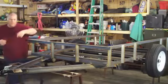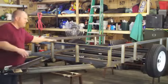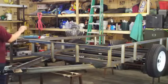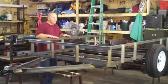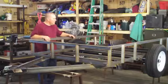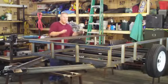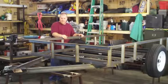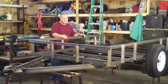I just wanted to give you an example — look at this, watch the trailer. Before this framework was on, that was flexing a little bit. Even if you just wanted a flatbed, this bridging really helps — this is what gives your trailer strength. It's looking heavier duty as we go. Once we get the fenders in, everything helps. My next step, I'm thinking I might mount the fenders, and then we can mess with the ramp tailgate in a little bit.